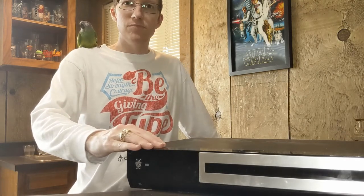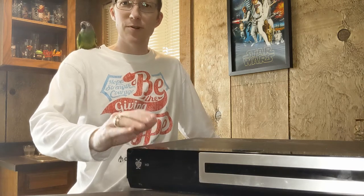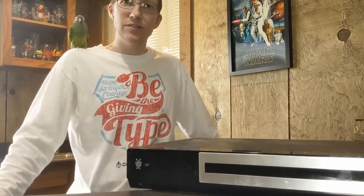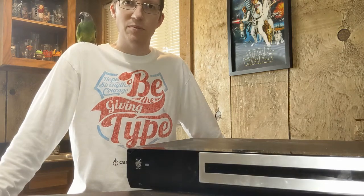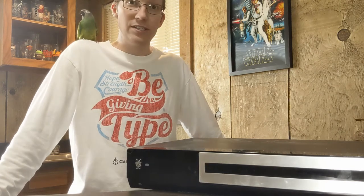This is a TiVo from 2009. It was a refurb that we got. It's been working really well, but it just kind of stopped. I think it may just be the power supply. A little bit of googling and looking around in different forums — it seems to be that there's a problem with the power supply capacitors going bad. I've taken a quick look and that definitely could be it. So I'm going to work on replacing those. This may work for several different types of devices — it's a relatively common problem, especially in older electronics. So let's try fixing this together.